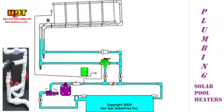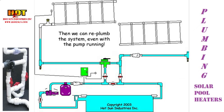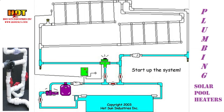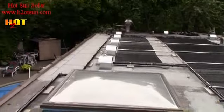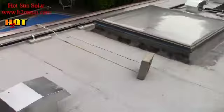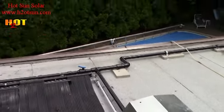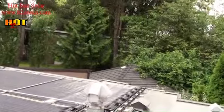So here's some examples. The two-inch main feeds this bank, restricting it because it's a smaller bank — it will take more flow so we restrict some flow to the significantly smaller bank. Inch and a half plus inch and a half equals two inch. That pipe feeds the third bank.